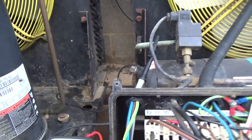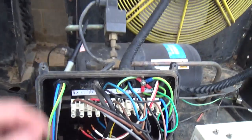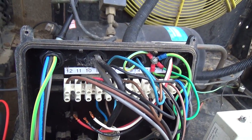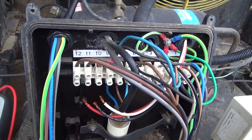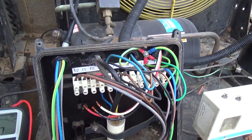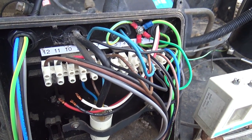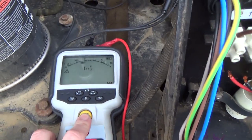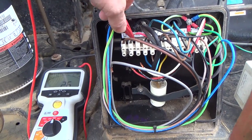I think we've re-tested it and there's something fuzzy on that wire, which is the one which feeds the fan motor - which we've tested - but there might be something odd going on there. So we might pull that wire out and test it. We should be going back up the neutral unless he's got full pole switches, so he should be switching the neutrals. Because that's the other thing you have to be careful of - it'll go back up the neutral wire. That's the incoming phase, which is OK. So we've got this little link wire here.